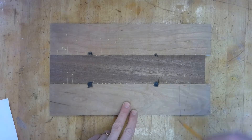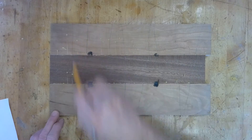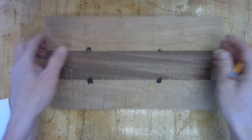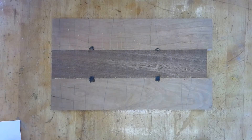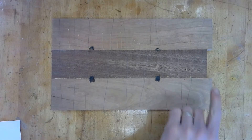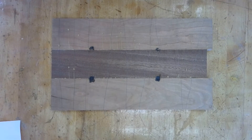I'm going to draw lines all over the entire surface, and I'll do the same thing on the backside. Then I'm going to run this through the planer — I'll operate it and you will assist me. You can stand on the other side and grab the board as it comes out, inspect it, and if it needs more planing give it back to me. When I say inspect it, we want to get rid of all these pencil marks.